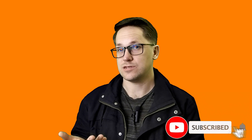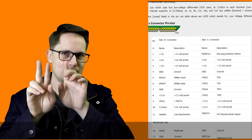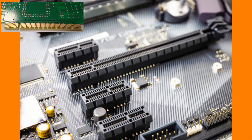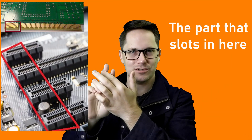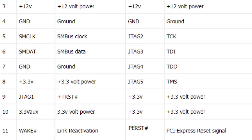So like a lot of things, there are standards in the world. This is true for the PCI Express standard. If you look at your PCI Express cards, any of them, they'll all be the same. You'll have a small notch on one side and a short or longer notch on the other side. We're going to focus on the first notch only, because that's all we need — which is the power. You'll have 12 volts, ground, and 3.3 volts. We are going to borrow the 12 volts from each card and wire it up to a fan. Okay, so off to the workbench.